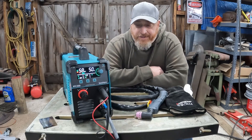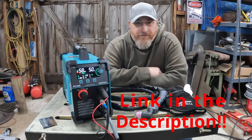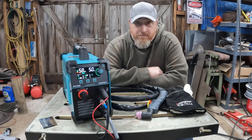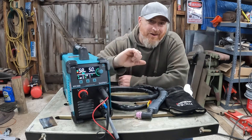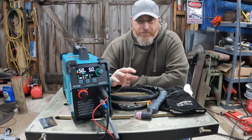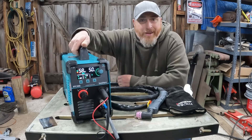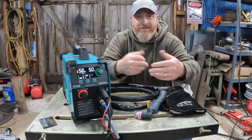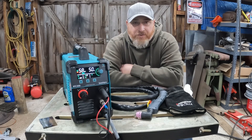There it is, cheap and dirty. These torches are only like 40 bucks, so if you already have a lift arc machine and want to make it a pilot arc, it's super easy. This takes about 15 minutes - take the connector apart, slide it back under there, wrench it back down. You don't need to disassemble the machine, you don't need to add connectors. If you ever wanted to remove cables, just cut it and put a blade connector in - there's no magic here, this is super simple. Hit that like and subscribe.